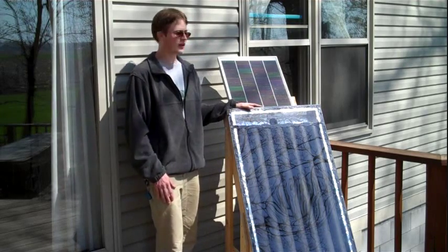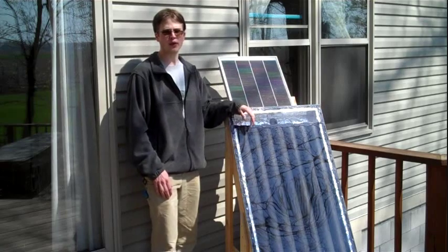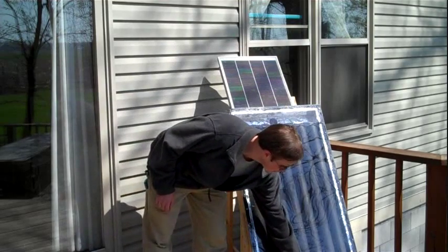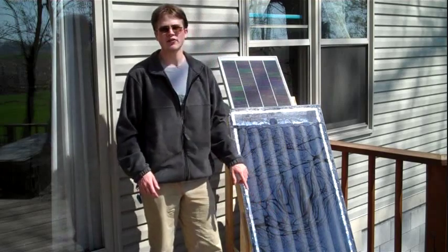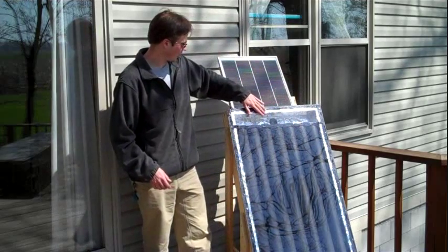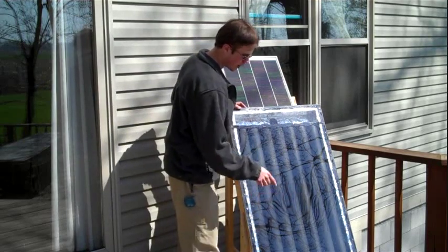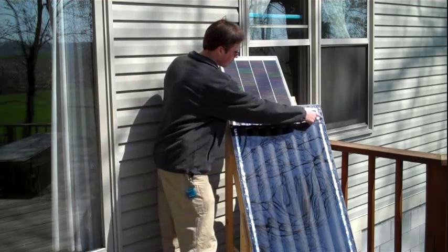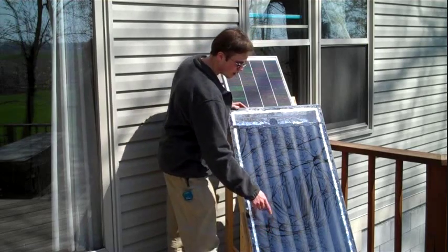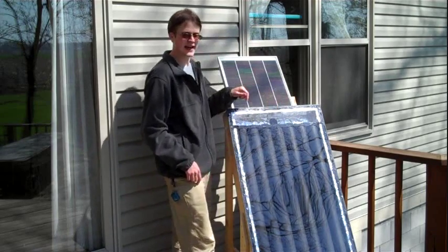The way this solar collector works is the solar panel on top goes into the house and connects to a blower unit that blows air from inside the house through a tube into the bottom of the collector. The air flows into the bottom header — just like the open area you see at the top — and because the headers are sealed all around with caulk, the air has nowhere to go but through the open columns. It flows from the bottom up through the columns, collecting all the heat, then pools in the top header and goes back out into the house.